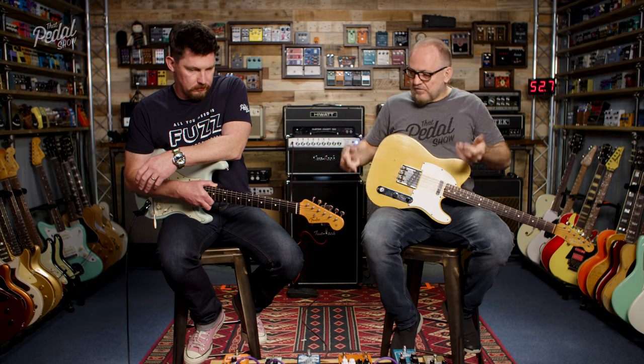Just think of your tone knob, all right? The more you wind your tone knob in, the more capacitance you're adding to the signal, and your signal gets darker. It's exactly the same in this scenario. It's as if we've got this tone control after the Secret Machine that is wound right down, which is basically the effect of all this cable going back to the amp. As soon as we turn on the Immortal Echo, it drives all that capacitance. Yeah. That's it, isn't it?